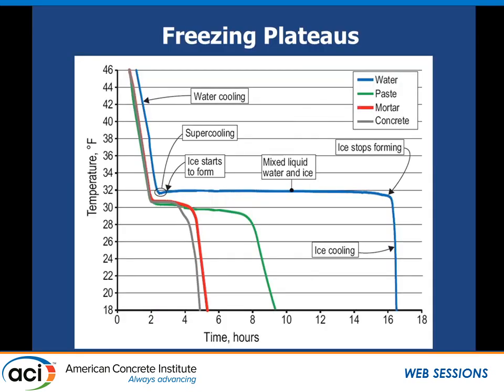To detect freezing, whenever you freeze water you always get a plateau: the temperature drops to 32°F and stays there as ice forms. Once it's solid ice, it acts as a solid and continues cooling. We tested water, paste, mortar, and concrete using the same volume for each. With pure water there was plenty available, so it took longer to pass through the freezing stage. With paste, mortar, and concrete, the less water present, the less pronounced the plateau — but in every case, even concrete showed a freezing plateau.